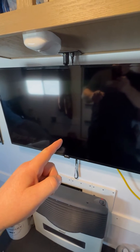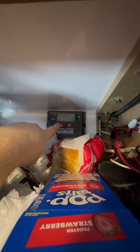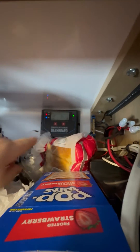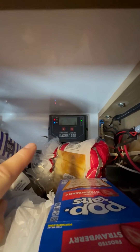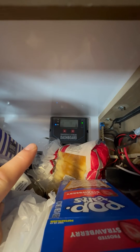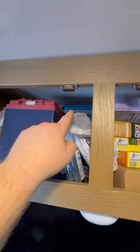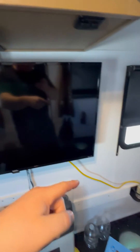Because of this setup we don't have to have a generator, but we like to watch movies at night and charge our devices, which we're doing right now. With a 100 watt solar panel it's currently charging at 5.1 amps. It's about 11 o'clock and the battery is at 73 percent. We started at 100 percent last night — it was dark when we arrived so the solar wasn't doing anything — and the 100 amp hour battery ran the inverter and TV for probably six hours and never got below 73 percent.